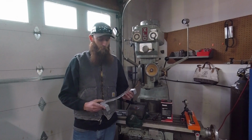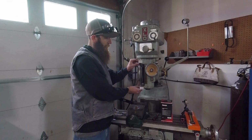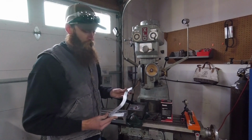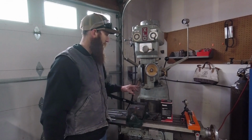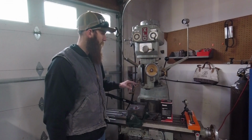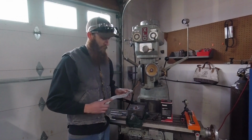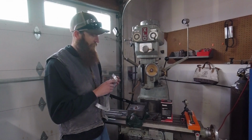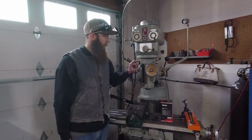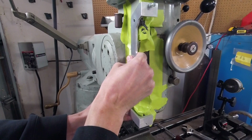Hey guys, so in part 1 we made this aluminum bracket here that'll attach to the side of the head, and the digital reader will sit here. We CNC routed this on the Certiflat CNC, and I have a machine surface here and a head casting side here. It's not a flat surface, not true or parallel with this machine surface. So I'm going to try to reverse mold that onto the bracket here using some Devcon Plastic Steel Putty, and I will also be making the back of the reader mount that attaches to the quill. Here we go.